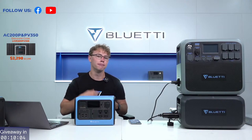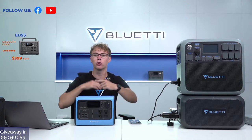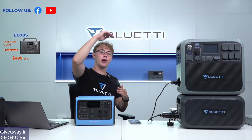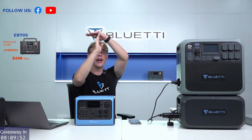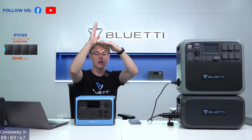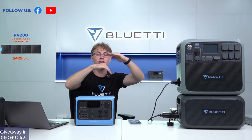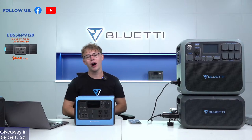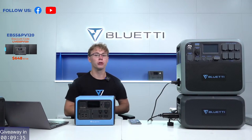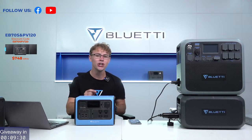When you plug in a device with a motor or with an inverter, you'll experience a peak, okay? So when you plug it in, the motor kicks on. It takes a lot of energy to kick on actually, right? So it spikes and then it drops down. So on the spike, it cannot go higher than 1400 watts, right? If it goes higher than that, overload. And then it drops down. As long as it drops below 700 watts, you're safe and you can keep running this device normally, okay? Now we have 13 outputs right here, and we'll take a look at each and every one of them.